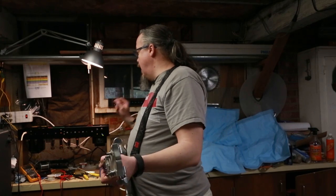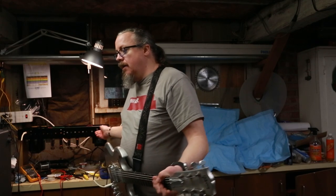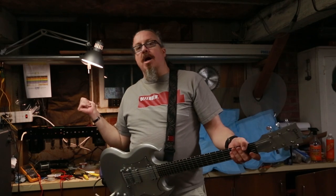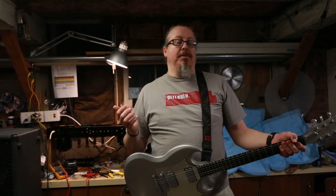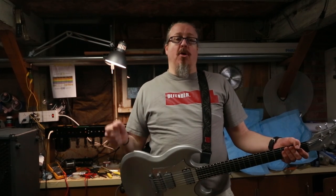So the other troubleshooting, I just want to recap. I'm going to turn the amp off to remove the hum here. The other troubleshooting steps we went through were really just using the oscilloscope, finding where things were. That little bit where I was alternating between those two points around that cap turned out probably to be a red herring. More than anything, the bigger issue was maybe that the oscilloscope probe at that point was causing some kind of feedback, and it was just the probe that was causing the issue.